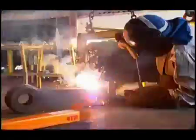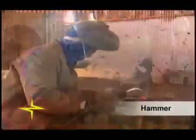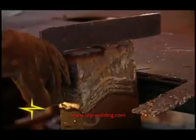Wherever they are already in use, we firstly rebuild their profile with a low or medium alloy electrode before applying the cover. With the arrival of flux cored wire, this welding process has been optimized since it allows UTP-AF Ledurit 60 or UTP-AF Ledurit 68 wires with a 2.4 millimeter diameter to be applied, providing maximum effectiveness in the application and the results.